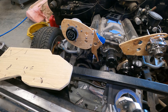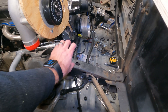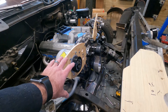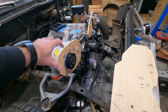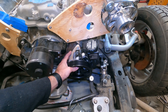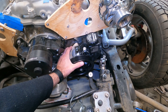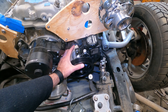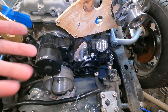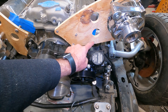It's the wheel well that comes down right here. If I put a tube here, I've got suspension travel to worry about. So I still might have to either clock this a little bit that way or lift it another inch. This bracket needs to be right up against the block, and these holes actually need to be threaded, because I'm not going to have any room to put a bolt on the back. If I'm going to make them threaded, this should probably not be aluminum — maybe this should be steel, because you can strip threads in aluminum.